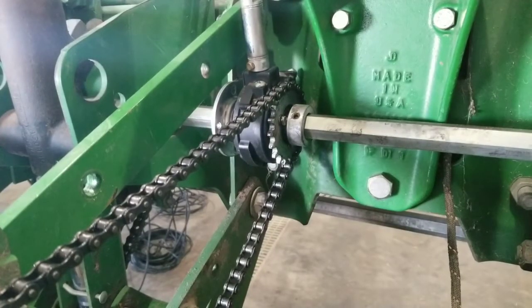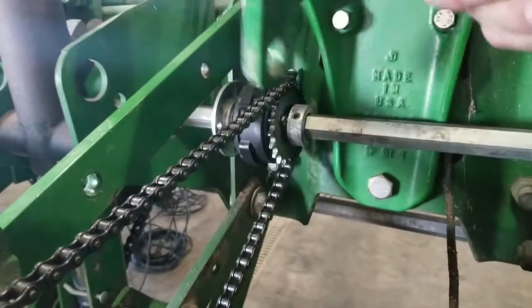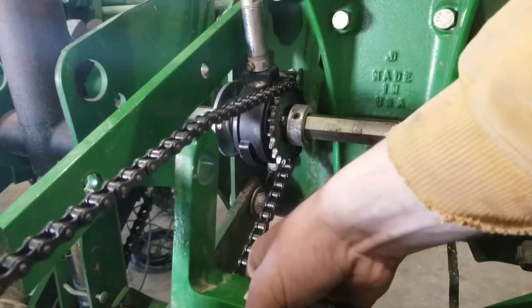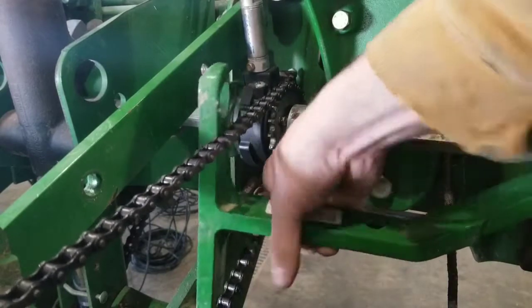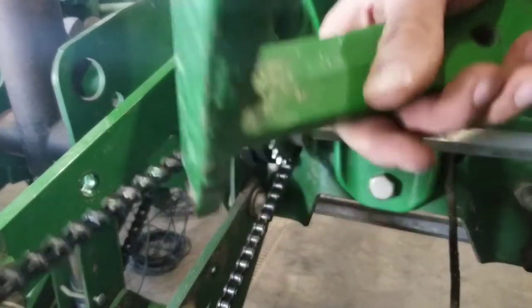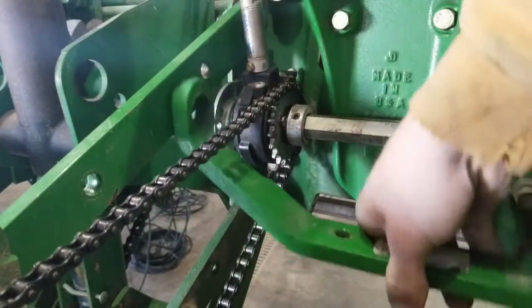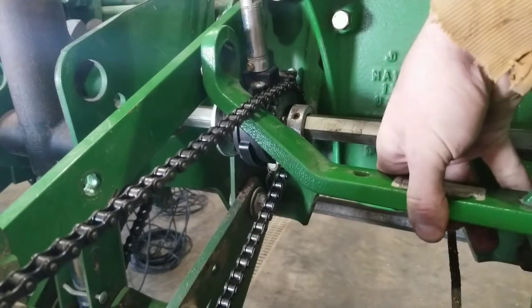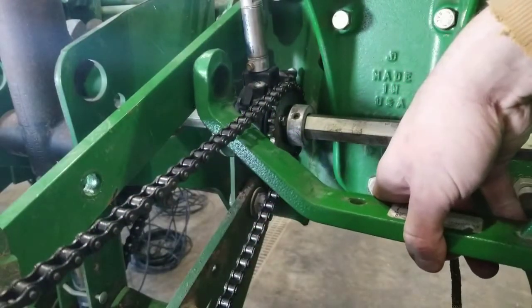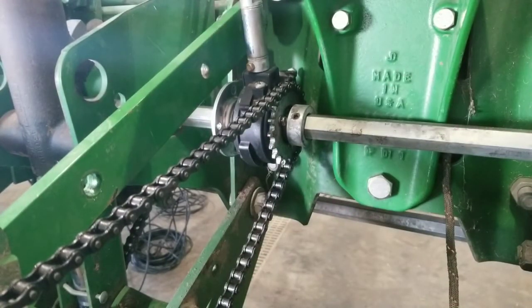Next thing will be to mount up the bracket that the airbag goes on. Note that if you have a chain-driven planter, the bracket goes like this between the chain. If you had a ProDrive planter with a cable, you flip it around — they would go like that — and the ProDrive runs underneath this thing but it makes contact with the chain. So that's the only difference for a chain-driven planter: we're going to run it backwards.